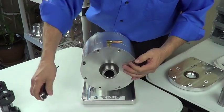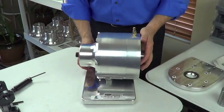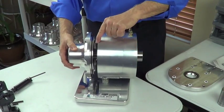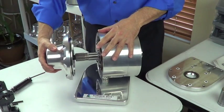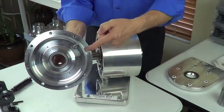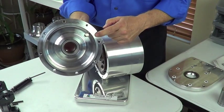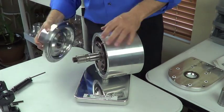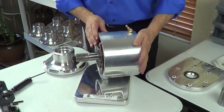Hopefully a nice clean environment to work on the unit if you need to. So just a couple of reverse through bolts. Now we can actually take the housings apart — I can just wiggle the tail housing off of its alignment pins. The other thing that's making it a little stiff to pull off is the O-ring. There's a large Viton O-ring that's sealing into the next unit inside. We're not sealing against the flanges — no gaskets whatsoever. There are no gaskets in this unit, just internal O-rings, about 20 thousandths compression fit inside the next unit. That's the way our unit is put together and sealed.